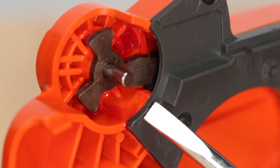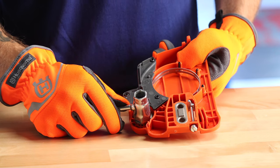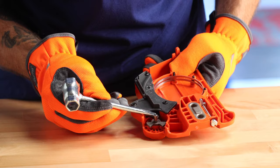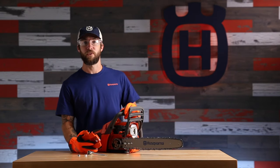Here's the link shown in a downward position. To reset the brake, rotate the link clockwise until it stops. You'll notice the bottom link is in the downward position. Now that you've reset the chain brake, you can go ahead and reassemble your saw.